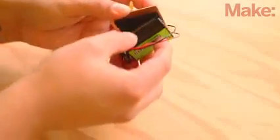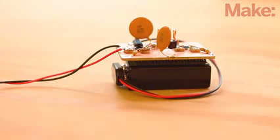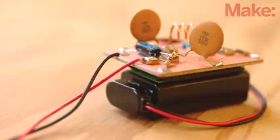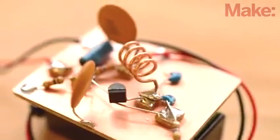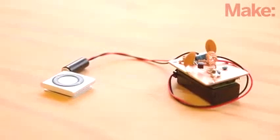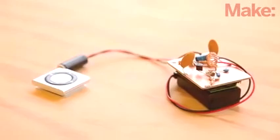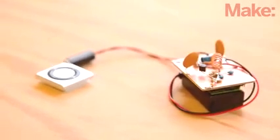To make your transmitter more portable, you can attach the 9-volt battery to the back of the circuit board with some Velcro or double-sided tape. Depending on your equipment and the broadcast spectrum in your area, you should be able to receive transmissions up to 30 feet away. It is possible to boost that distance by adding an antenna, but remember that in most countries you are supposed to have a license to operate an FM transmitter. Be considerate of others, and remember that unlicensed broadcasters can get in legal trouble if they interfere with normal public use of the radio spectrum.